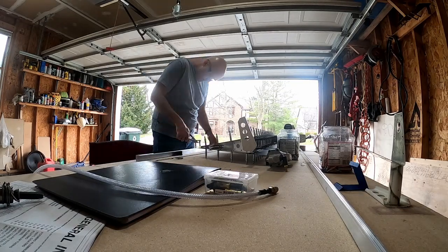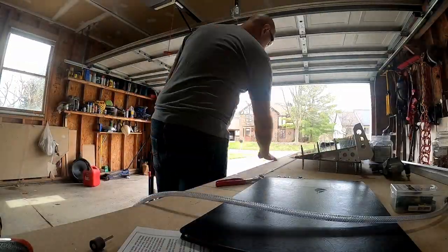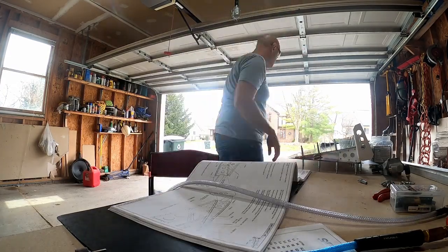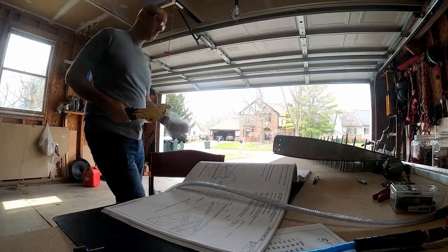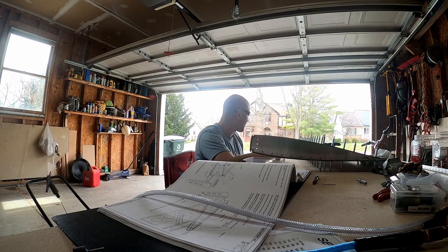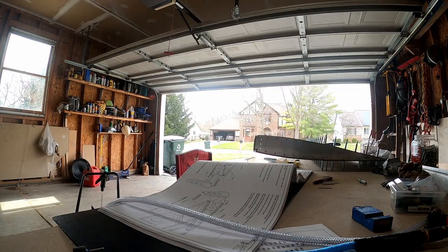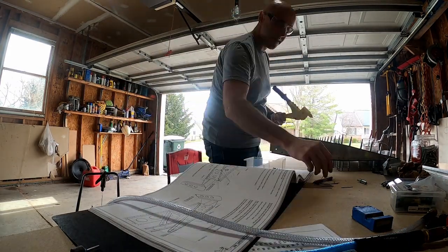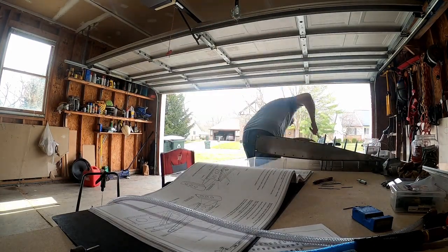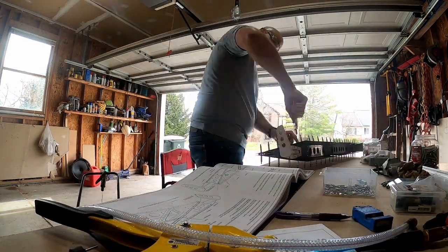So here, what I'm doing is I have a few extra pieces of angle aluminum and I'm matching them up with the original piece, which fits the trailing edge really nicely. In the next video, we'll be attaching the skins to the skeleton — the front spar, root rib and tip rib. And then after that, we'll be using tank sealant to put in the trailing edge foam ribs. But for right now we need to get the skeleton attached to the stiffeners and the skeleton also attached to the skin. So that's what will be happening here for at least a little while.